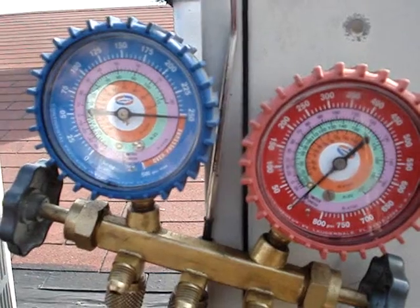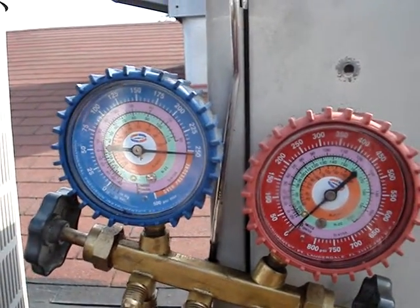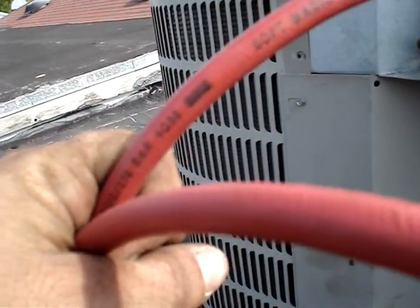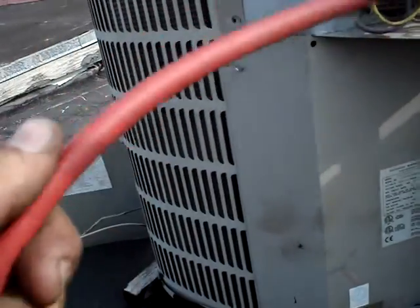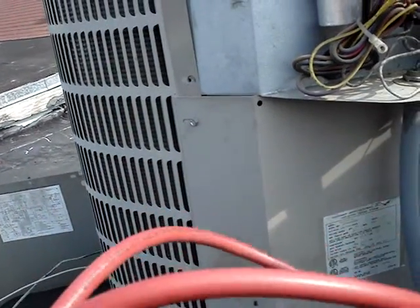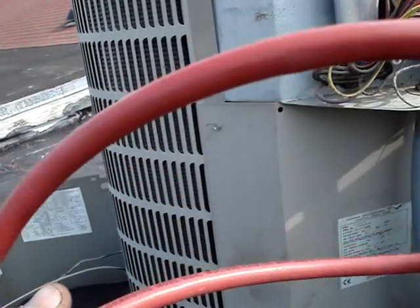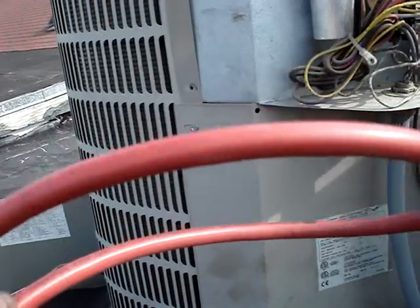We found our leak and repaired it, but I still saw the pressure dropping. So I jacked it up to 250 psi and found my other leak, which was right here — in my own hose. Unbelievable. It blew out one of the little puncture marks and it was popping. So I had to go get a new hose. We'll monitor it to make sure it doesn't fall, but that was probably the only system leak. So there's one leak that appeared over time and one leak that appeared in my own hose. Next step: vacuum pump.